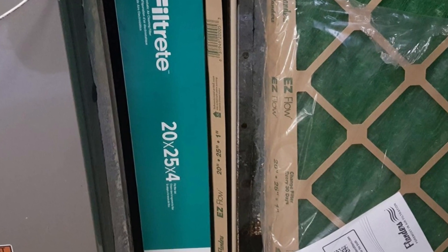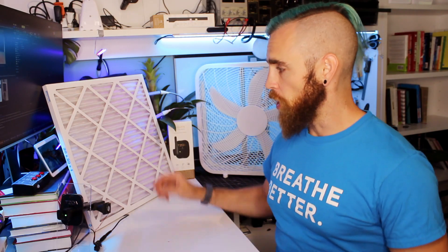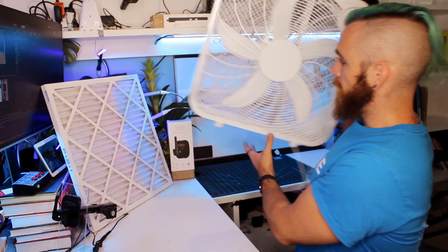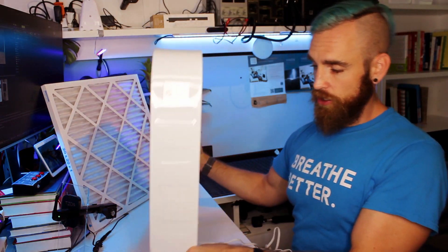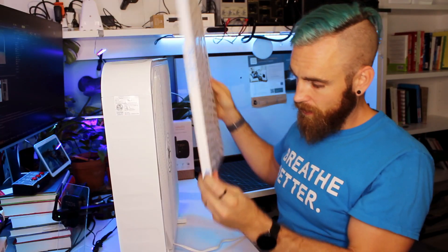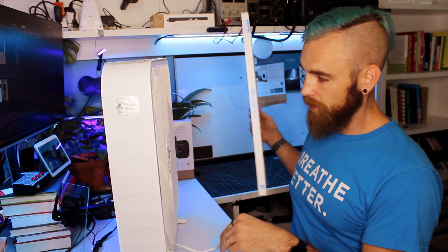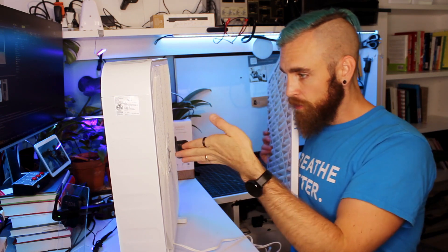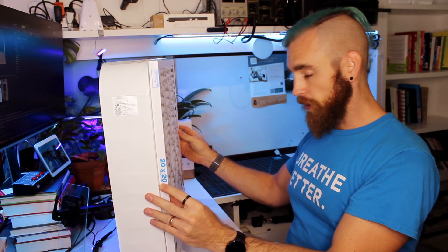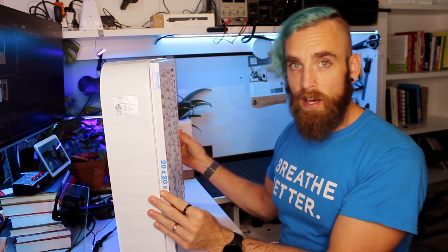Though I only have a one inch filter here, I recommend that you go with a two inch or four inch depth filter. The deeper filter works a little bit better and it'll last a little bit longer — I'm only using a one inch filter because that's all I had on hand. When you're installing the filter on the fan, you need to make sure that you pay attention to the direction of the airflow as indicated by the filter. There'll be a tiny little arrow somewhere on the filter that tells you the air is supposed to come through one side and out the other. I know that this fan pulls in air through this side and pushes it out the front, so I will always make sure to put this filter on the back side in the direction of the airflow.